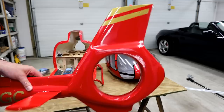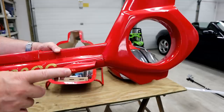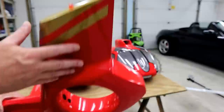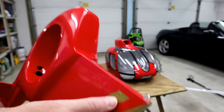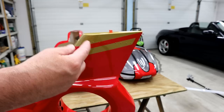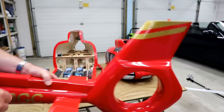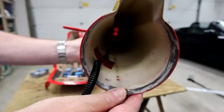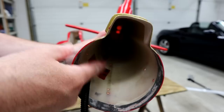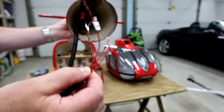While we're on the lights, I've got all the LEDs mounted in the tail section — there's provision for three: the two side positioning lights and the top beacon light. But if you look at night photos of EC-130s, there's also a white position light on top of the tail fin. So I got a big white LED and fired it in there, soldered it up. Fishing those wires back through the tail unit wasn't exactly easy — had to use mechanics wire, shape it, fish it through. The wiring is taped and glued down inside so it won't interfere with the tail boom mechanics. It comes out on cable loom housing four wires for the four lights, which plug into the little control module.